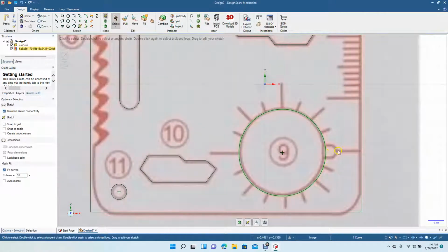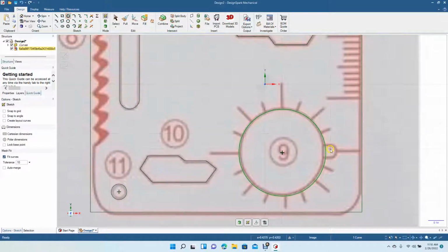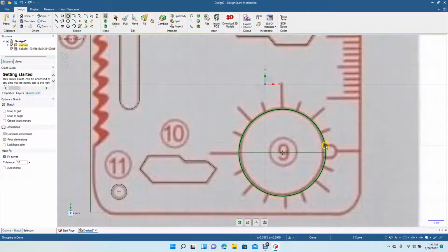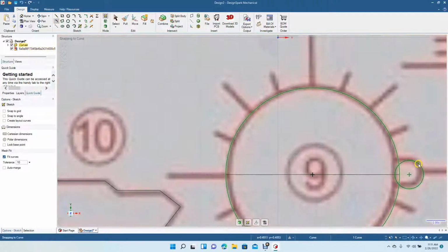Now you're gonna do this piece here. This needs to be cut out, so let's draw a line in there. Straight across. Okay, that's gonna help us make sure that our line is center. So we're gonna draw a, I think 0.092 is gonna be good. Then we're gonna get our tangent line. Let's zoom in, Control Plus. We're gonna go from there straight across. You can overdraw if you want. Grab the line tool again, straight down, get our trim away, trim away these pieces here.